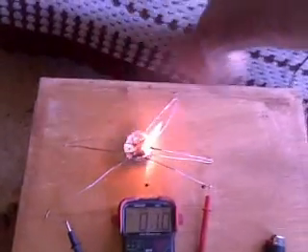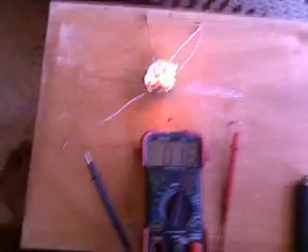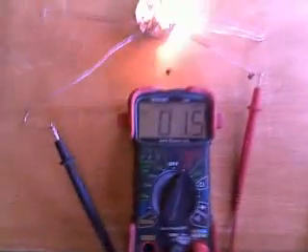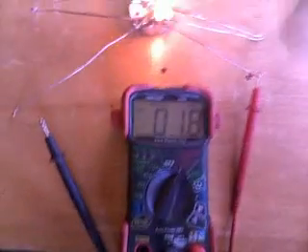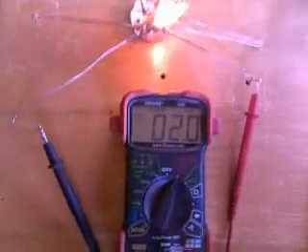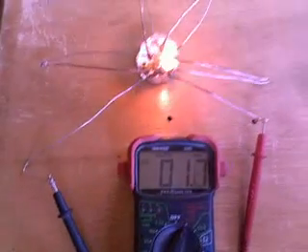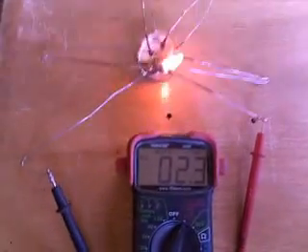So I'm going to start fanning it. You can see my hand fanning, and already we're over one millivolt. I'm going to keep fanning and see if we can really get that current to jump up. We've hit 1.5 — let's see if I can get it any better. 1.6. What I'm doing here is as I'm fanning I'm also blowing the candle around so it's not heating the centers as effectively. But there we go — we finally jump to two millivolts. Now I'm going to stop fanning and you'll watch that immediately start dropping back down. And now fanning again — you see it immediately start rising right back up. What you're witnessing is the Seebeck effect: when you heat and cool each side of two dissimilar conductors, you create electricity.